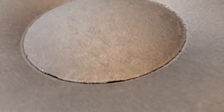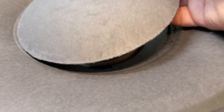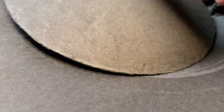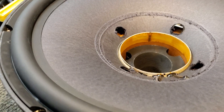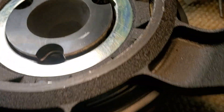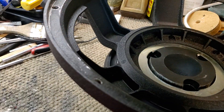There was an issue with the epoxy coming apart on some of these, so I've been tasked to repair this. I've already disassembled it, as you can see, because the dome typically doesn't lift off that easily. I've managed to remove the black cyanoacrylate adhesive that bonds this gigantic dome in place, and I've pulled the moving assembly out. This is a vented gap cooling design — the motor is pretty much the same as a 2242 or a 2227. It's got extreme excursion to it.